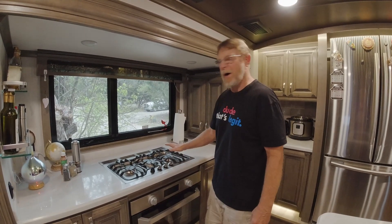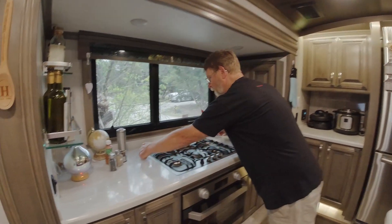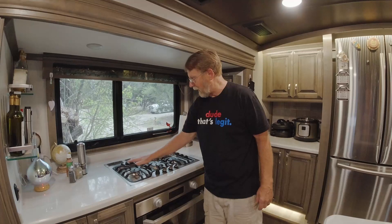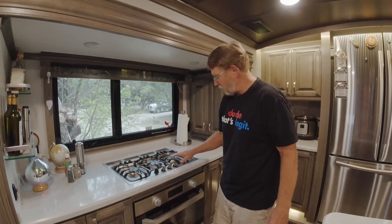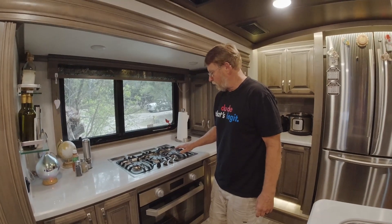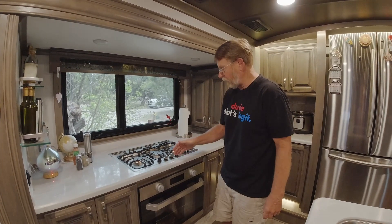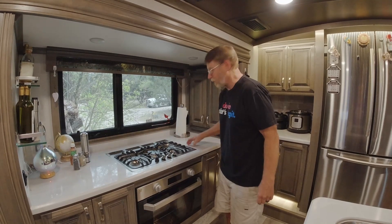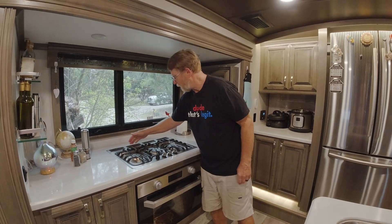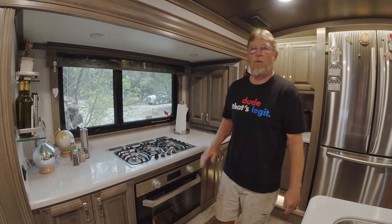So what we're going to do — what we bought off Amazon — was a new 30-inch cooktop, which is going to involve me cutting this counter out a little bit. It's actually a five-burner. It's got real heavy cast iron grates instead of these little floppy rubber held-down things. This one's also hard to clean; even though I clean it all the time, I feel like it always looks dirty. So our upgrade is to put our new five-burner in here, cut this out, reinforce the countertop, glue in some 2x2s. Back here there's a vent for the oven which I'll have to build a new box for. That's what we're going to work on today.